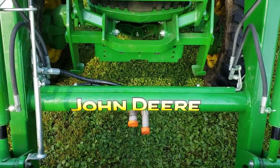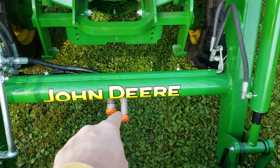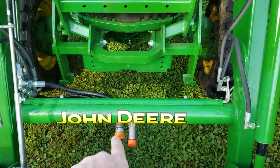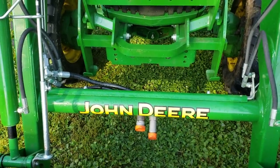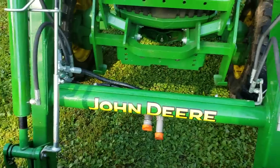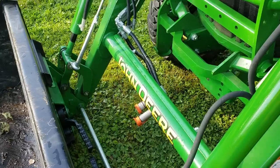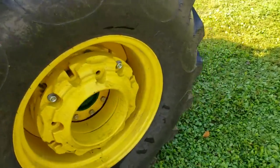Going with skid steer style couplers again — it's a great system. Anything skid steer is easy to find used parts for, which is very convenient. This setup was kind of genius: running off the rear SCVs with the power beyond kit, you can run a low-demand skid steer implement — light brush cutting, light snow blowing. It's a neat functionality. There's a reason the previous owner didn't do the true third SCV or third function up front — he was definitely thinking ahead.